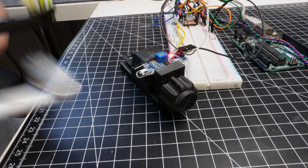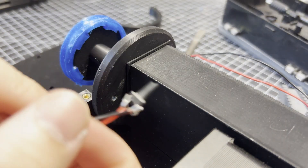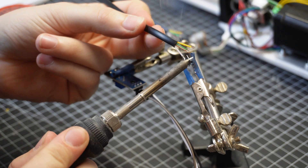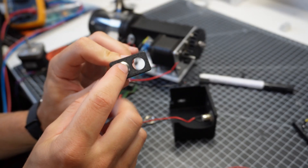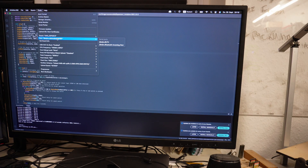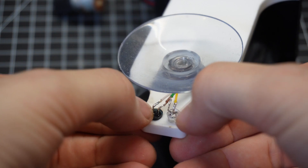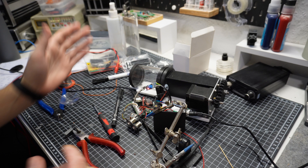Then came the electronics, and we're already like 10 minutes into the video so I'll make this quick. I started by prototyping the whole thing on a breadboard, then I decided I needed end switches so the extruder won't destroy itself. I added those, printed new parts, cut the perfboard, sorted everything up, then I thought I'd need a switch for refilling so I can move the plunger up without manually turning the gear. Then I managed to fry my fancy ESP board, motor driver, and adapter while setting up OTA — over-the-air update. I think it was a faulty buck converter. After that it was a lot of testing and I got toothpaste all over my workbench, and after a lot more testing I finally thought I was done.